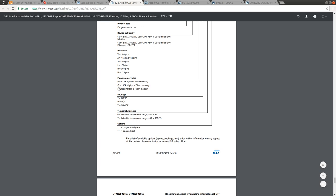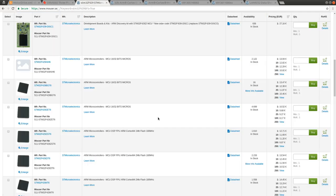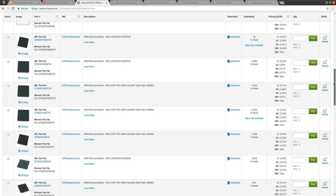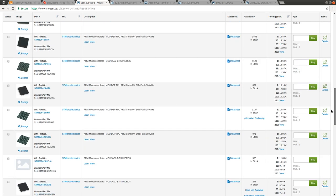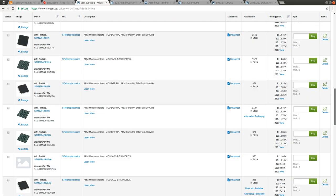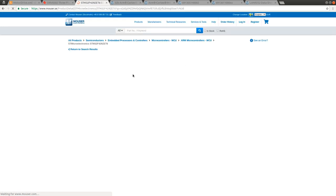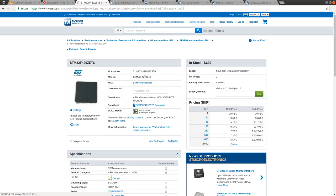So E is the memory size. I could go with a chip that has less flash, which is a little bit cheaper. The ET6 is pretty well stocked - 512 kilobytes is plenty for an application like this, and it's cheaper than a Teensy. I'm going to pick this chip - this microcontroller.